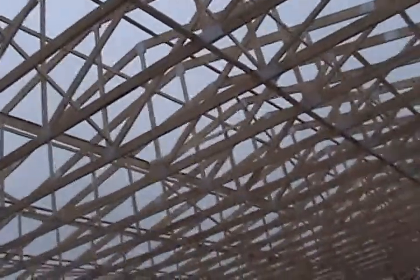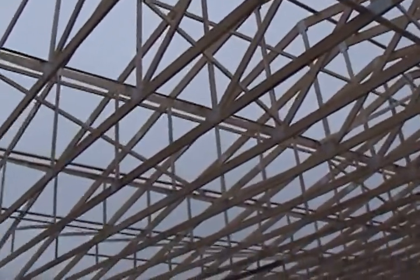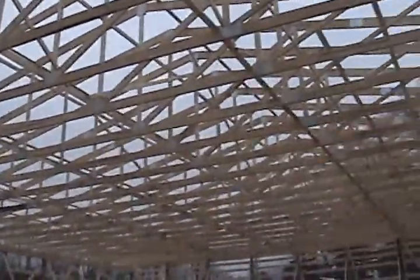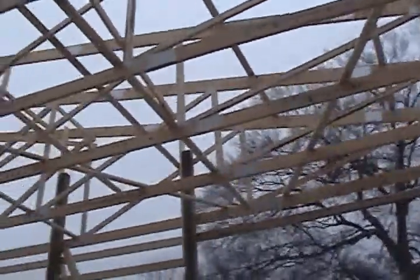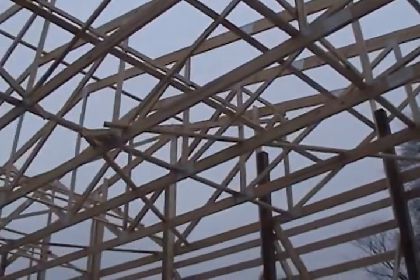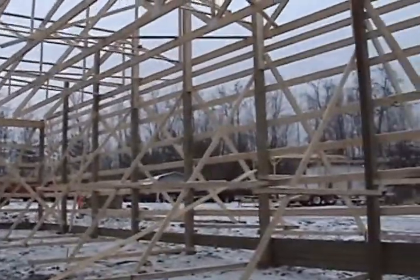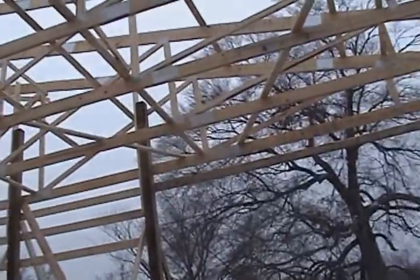As we go we put the diagonal storm bracing in at about 4 different spots. You can see we put a lot of stringers in on top and the bottom chord and in the webbing as we go — this keeps the shake out, and if you don't do this you're risking terrible danger. On the end where you've set everything from the gable end, you need to put crow's foot bracing in: diagonals down to the poles, then down to the A-bracing on the wall. That keeps everything going up straight, square, and level.